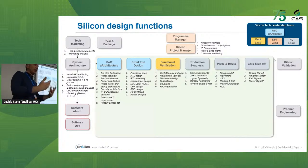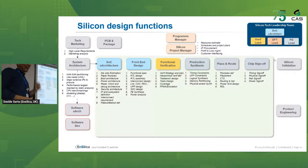Of course, we are not designing software here, we are designing hardware, which has to work at a certain frequency. So somebody has to tell exactly what is the frequency, what are the constraints on the IOs, and so on. You do a light synthesis before you hand over your RTL to the next step, which I will mention, implementation basically. You do a light front-end synthesis to make sure that there is a chance to achieve your final speed. You may want to design a block at 1 gigahertz. That is not simple. Depending on the technology, it might not be an easy thing to do.